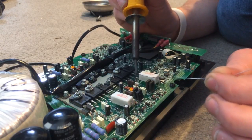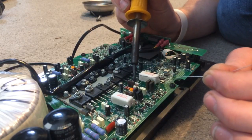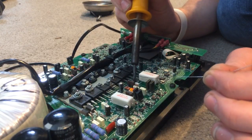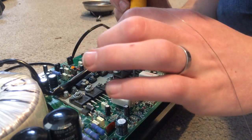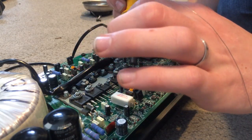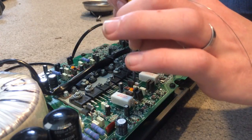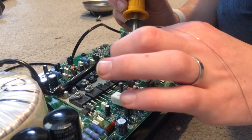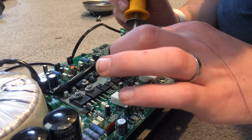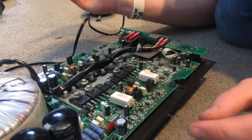You'll see the solder melt and flow. Add a lot of solder on that guy — you want to make sure these things are making a great connection, because these are very high voltage going straight to your capacitors. Then do the same thing on the middle — little taps, and make sure you're getting good contact between your soldering iron and that point for good heat transfer. Don't push so hard you rip the board up — just rest the iron next to it. When you see the solder wave and it's melted, you're done.